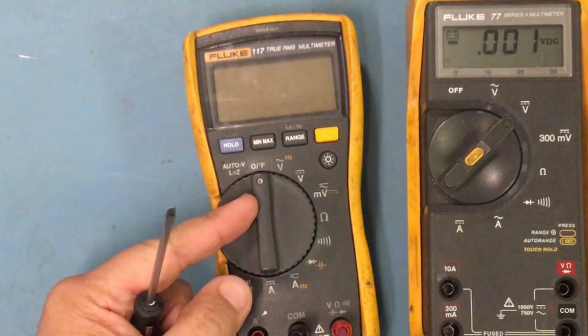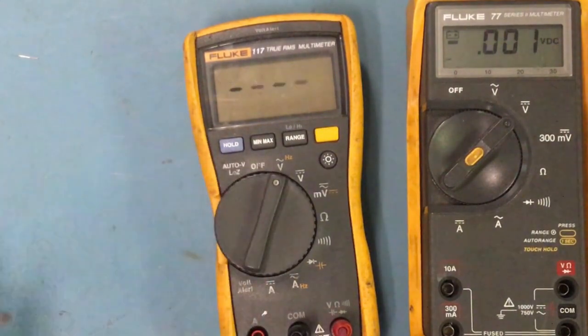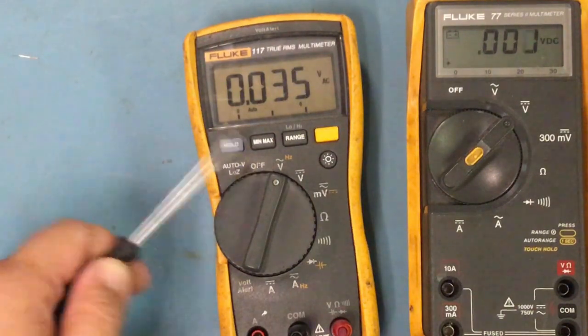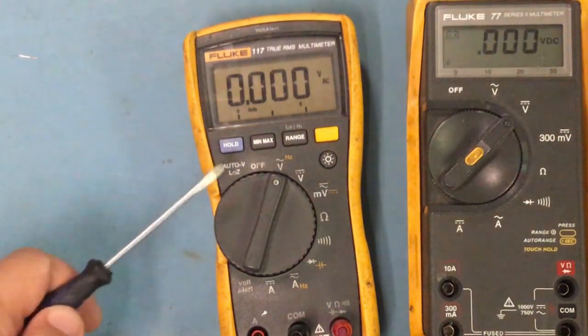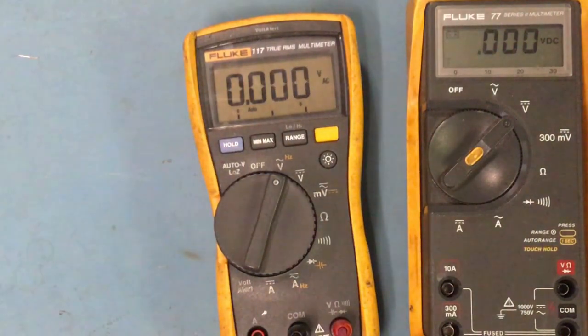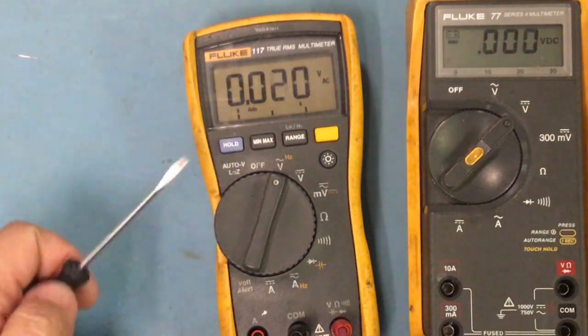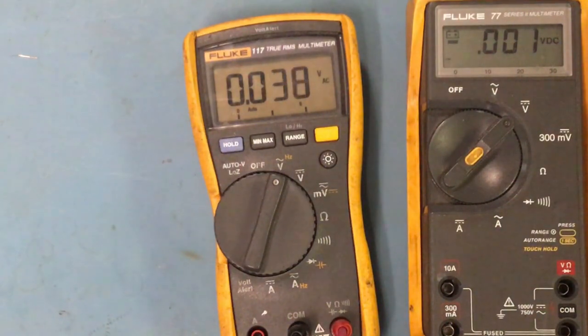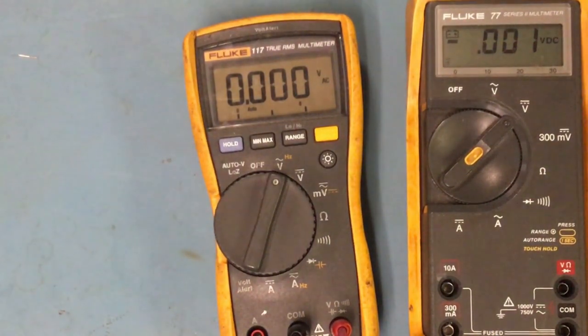Obviously the off, and then this right here, your sine wave. You see your sine wave is for your voltage. All meters have that, and like I said, these right here automatically adjust to whatever voltage is reading, and it will display that as you guys saw. On top is your duty cycle or frequency. If you guys want to read some kind of frequency, then you could put it on there.